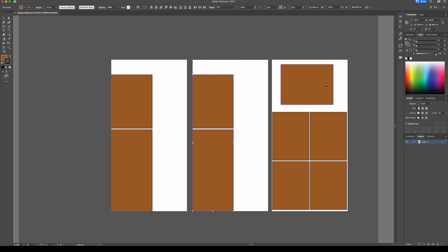The other thing is that middle shelf, the grain is going to go the wrong way. And because I couldn't get this to fit in anywhere, I'm going to be okay with that. And you're not really even going to see that middle shelf because it's going to be covered up with stuff anyway. So now I have this all sketched up. I know I need 3 sheets of plywood and 4 sets of 24-inch drawer slides.